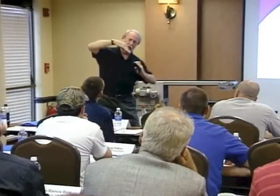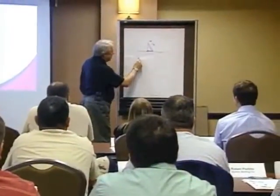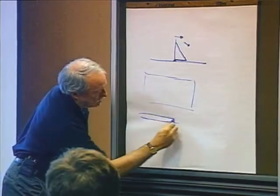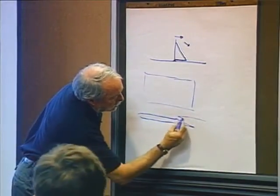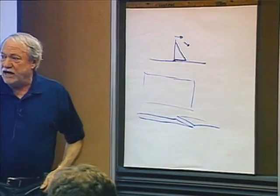You have come-alongs, and you're cranking that belt, and you're ratcheting it closer and closer together so you can put the press on it and stick it together. And that's where the splicing always amazed me, because when you splice nylon core, let me draw this for you. You have the belt like this, and let's look at the edge of the belt. That of course is much thinner. And we're talking about a skive splice, right? We talked about that yesterday. The skive here would be the other way, right? So that the two ends meet, the thickness of the belt is maintained, right?